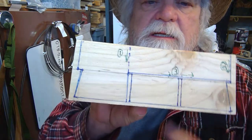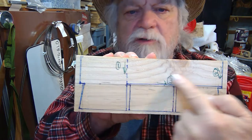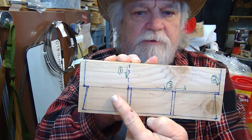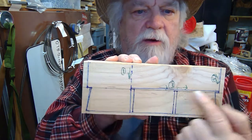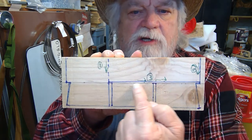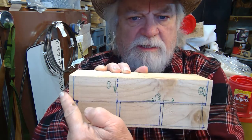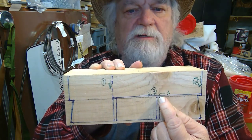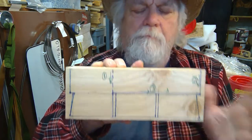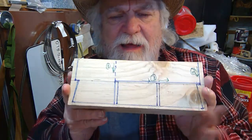And this is the layout. This block right here, from this cut to over here, is going to be that upper tray. And then these are the three little cutout cubbies down below. Two dividers. Then we have a little crisp edge there, and over here for that tray to sit on. So it's always sitting on at least two places and as many as three when it's in its natural position at this end or this end. It'll still sit on top of this one here. When you slide over here, this tray will sit on top of this one. So anyway, if you have any questions about how this is laid out, just let me know.